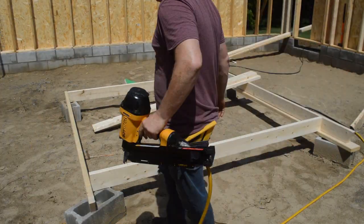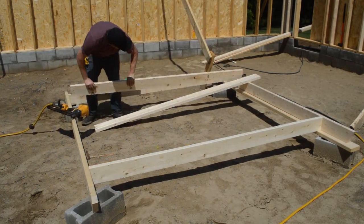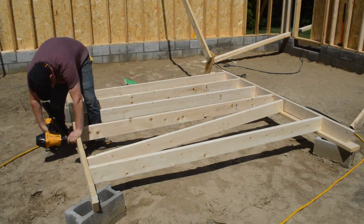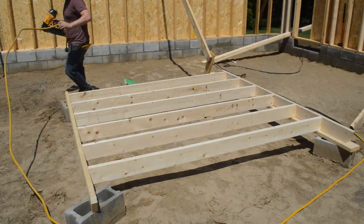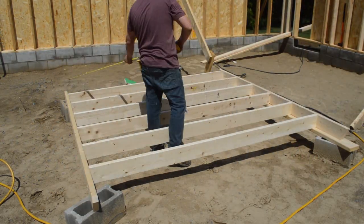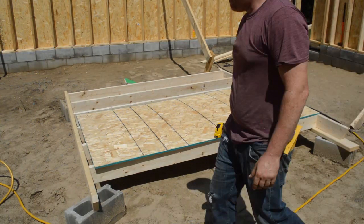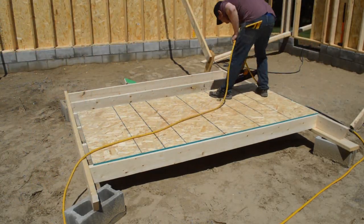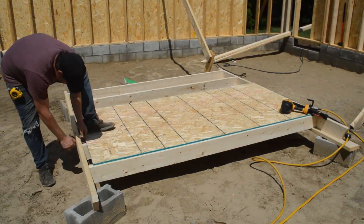Here's a time lapse of building a wall. This is a wall that's going to go from the addition to the house — it's a 2x6 wall. The studs are set on 16 inch centers. The top plate and the bottom plate I already have marked out with the 16 inch mark and the line is already scribed. I'm just using the air nailer — that thing is super handy, running off a compressor from the shop. I'll put the stud in place and a couple bumps and they're nailed in. Once they're all nailed in, I'm going to measure corner to corner to make sure the wall is super square, then put the sheathing down, nail it, and the wall will be square. Once I stand it up, I'll just get a level front to back and the wall is complete.